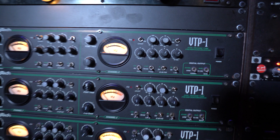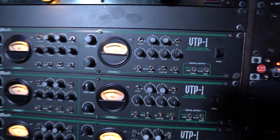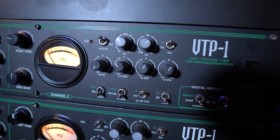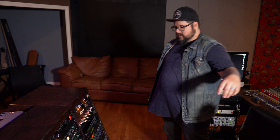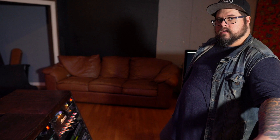These are great sounding EQs with very high headroom. I'm always padding them — even on an SM7B I have to put on the pad, because otherwise it just puts out so much gain. That's actually a cool hack for people looking to get an SM7 for their home studio who immediately think cloud lifter — if you get a good pre with a lot of gain, you don't need a cloud lifter. There's a ton of gain on those, and they're pretty clean too. One unit's a little noisy, but it's the one that doesn't have gold caps in it — all the other ones I've bought are modded from the same guy with gold caps.